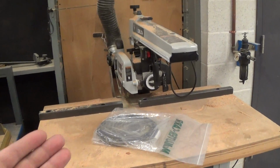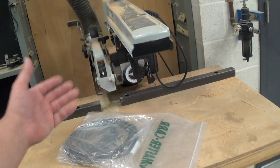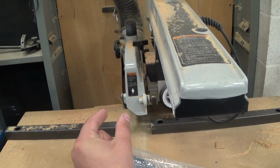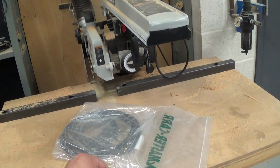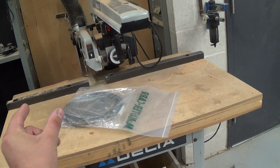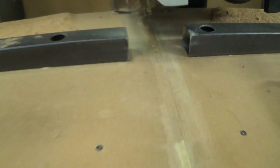We have another radial arm saw, similar to the one over there, but this one, if you can see, has a couple of blades stacked together. So that's called a dado stack. The purpose of this machine is to cut material out of a board, not all the way through, but in the middle of a board, and I could demonstrate that later, at a certain width, right? So that stack that's in there, I believe is set for 3/4, which is what we most commonly use it for. But you could shim it out, add an extra blade, and you can get pretty wide with it. Because you could even see how it doesn't even go all the way down.